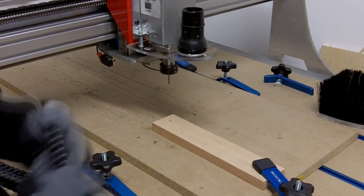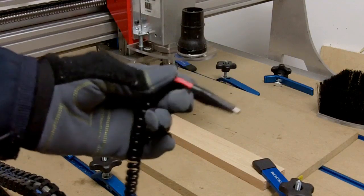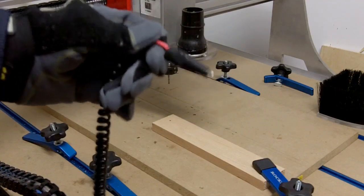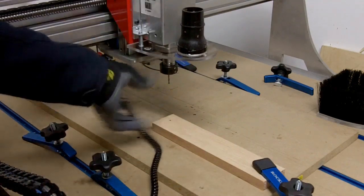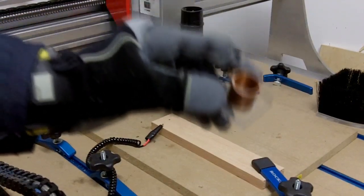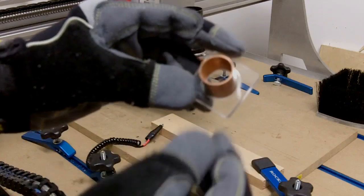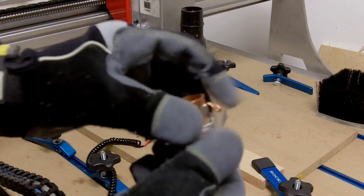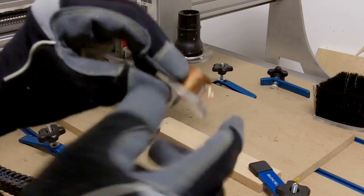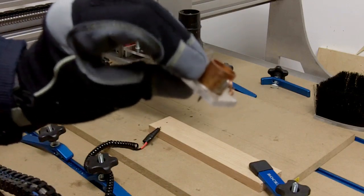I have a cable — as you can see it's flexible — this connects to the back of my CNC machine controller. I have mapped a pin to the back of my breakout board to actually touch this off and give me a signal. I've created a couple of touch probes. The first one is about an inch square plexiglass where I actually machined on the CNC machine a circle that accepts a typical copper water pipe — you can get this at any home store. Off the copper piece I've attached a little bit of wire that allows me to attach the alligator clip from that cable.